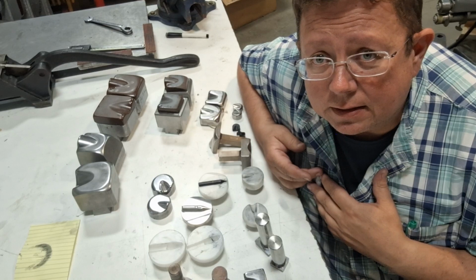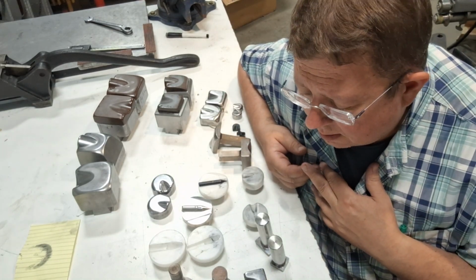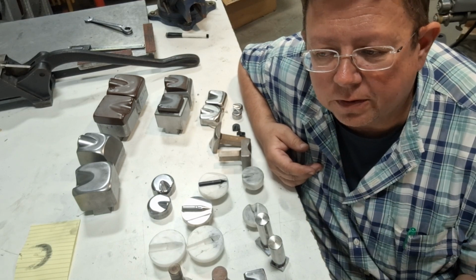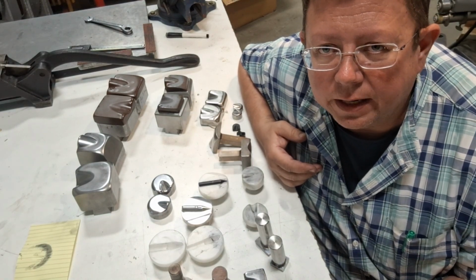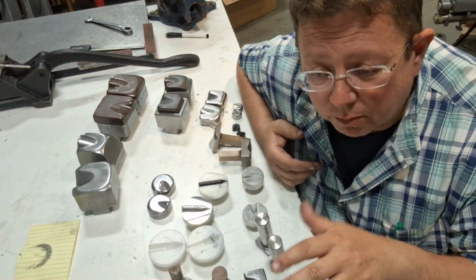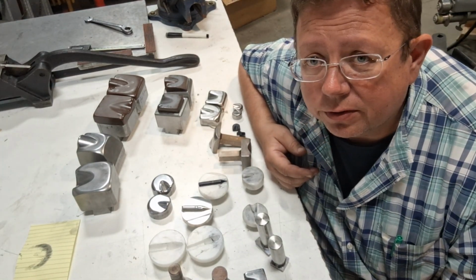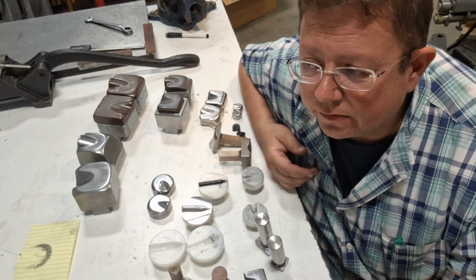For me as a machinist, I think in thousandths of an inch. That's how we manufacture. If it was a component that was a weldment, we would rough machine the component, weld it together, and then finish machine it. We would never finish machine something and then weld it together. Why? The problem is heat distortion. It'll cause the part to warp and twist. So that's a challenge when you buy these pieces: how do you know that they're still lined up after you welded it? And does it matter?